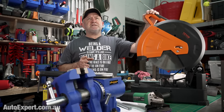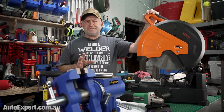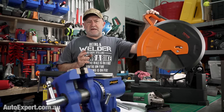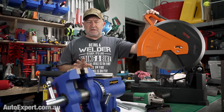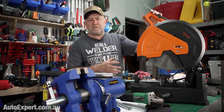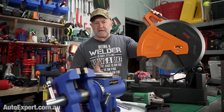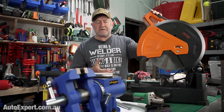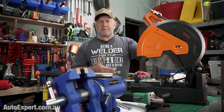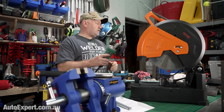Someone will have the bright idea of getting a metal cutting blade and putting it in a wood drop saw — also a terrible idea, because the speed will be wrong, the cutting will be wrong, and it'll be really dangerous. Don't do that. If you're going to cut metal with a tungsten carbide tipped blade, you need a specific saw because it runs at the right speed to correspond with the feed rate needed for efficient cutting. It's very difficult to adapt a wood saw to metal cutting for mild steel — that's almost impossible, and most people who try it get it spectacularly wrong.